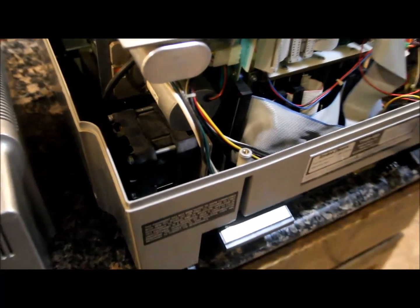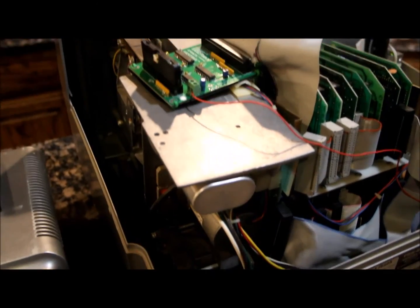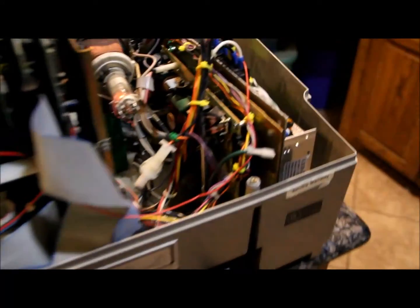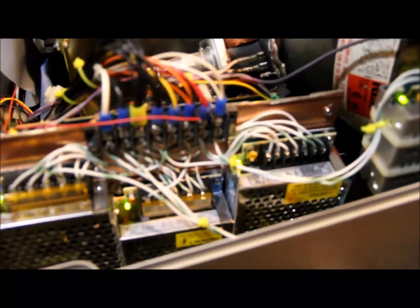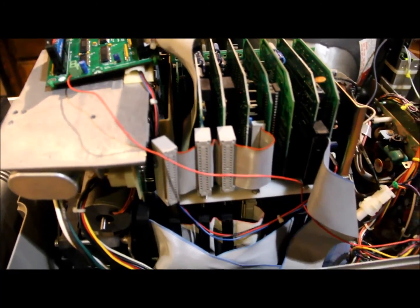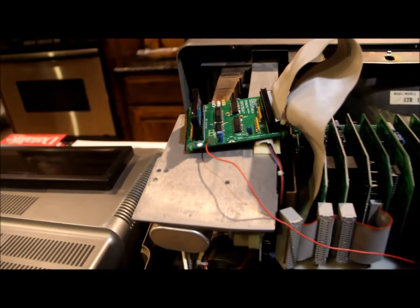You can also take the IDE controller out — that little cable actually powers the disc module. I've put some plastic on the back of the card so it's not shorting out sitting on the floppy drive, and I'm going to stuff it down inside the case at the bottom. There's not really a better place to mount it without cutting holes in the box, which I certainly don't want to do. That red wire is just pulling 5 volts off of the power supplies. Hans's adapter does have a mounting bracket, but I found extending the cable out to be a better approach.